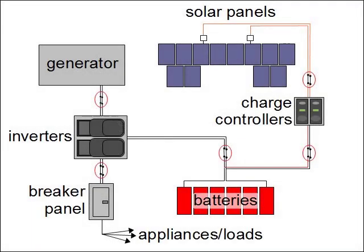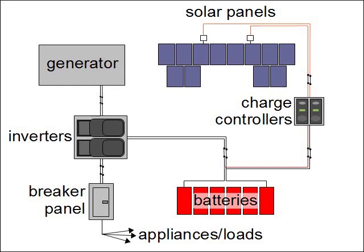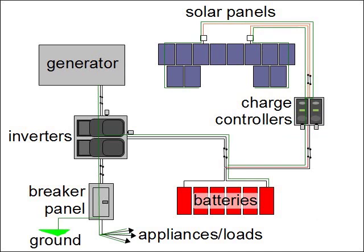While giving the tour I glossed over some of the safety features — mainly all those breakers and switches. Here they all are in our diagram, and here they are in real life. Some of them are mainly here in case there is a short circuit somewhere; the breakers will trip just like the breakers in your house would. Sometimes fuses are used instead. Another purpose is to isolate a piece of equipment in case you want to replace it or do some work on the wiring — for example, if you wanted to replace the charge controllers, you would first open the breakers on the wires before and after them. And then there are the various lightning arrestors. If lightning hits any of the parts on our roof, the large electrical current from that lightning would be channeled to ground instead of going through the equipment and damaging it. The only other safety feature is bonding all the equipment to ground. Basically, all the metal solar panel frames, metal cases, and so on all have wires connected to them which lead to ground. That way, if there is a short anywhere, the dangerous electrical current would go to ground instead of anyone who might touch the metal.